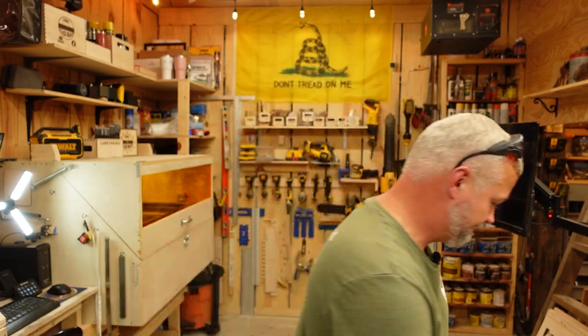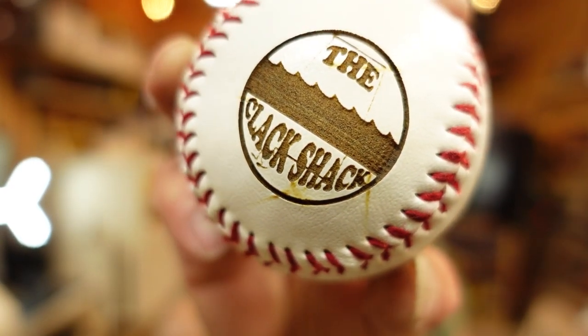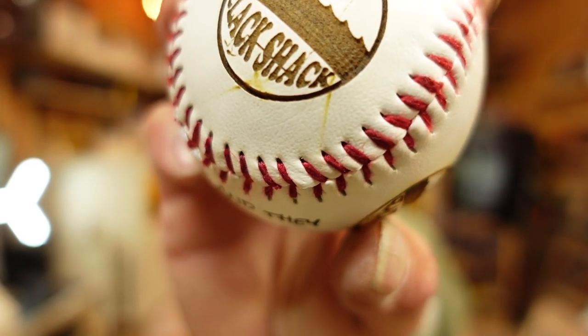To combat that, I've been trying a couple of different things. I tried the old approach of wrapping them in painter's tape — masking them — and it's somewhat effective. The problem I'm having with masking, and I'll show you on this one right here, is that if there are any creases in the mask — and this is a round object, so there's going to be some creases unless you're a lot better at masking round objects than I am — this is what you end up with. You can see those little lines of burn there. That is the creases that formed in the masking. You can't get them all out because this is not a flat object and you're using flat tape. So that approach is not exactly ideal.